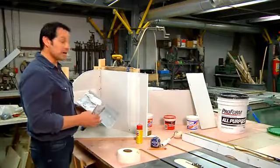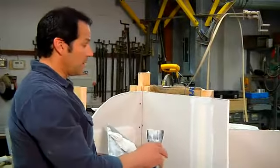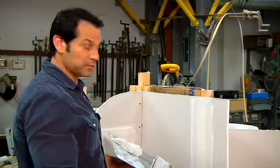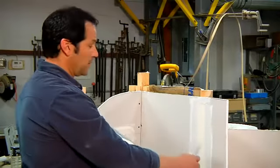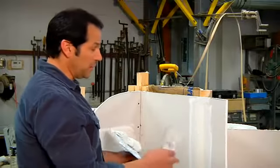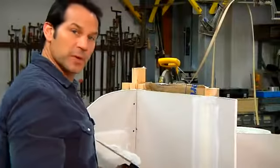Due to the positioning of the windows, the adjacent drywall has seams that can crack due to expansion and contraction of the window. If you do get a crack that occurs in the joint, you'd remove a section of the affected tape, clean out the joint of any loose compound, apply more compound, install a section of paper tape that was removed, and then apply finish coats of compound until the entire joint is sealed.